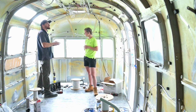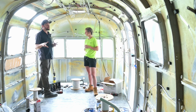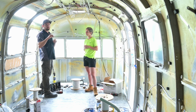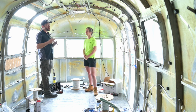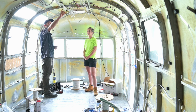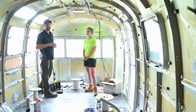One of the benefits to that is that everything is stranded wire, so even the 110 is stranded, so it's not like Romex. And the benefit there is that over time, there's the possibility that the solid core Romex, with movement, will eventually stress that copper wire so much that it can break. I can't say it's common, but it's a possibility, and it's one thing that we take out of the equation by using the stranded marine grade wire. The other thing is that all of the jacketing and insulation on the marine grade is rated to, I believe, 105 degrees Celsius.